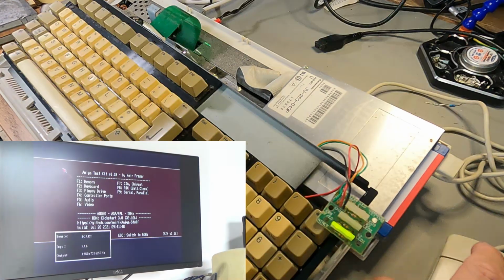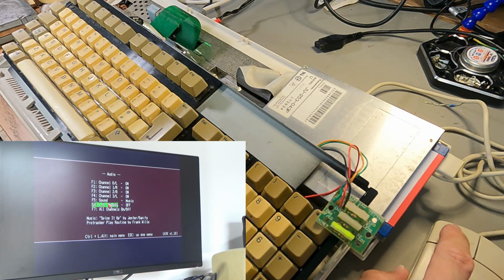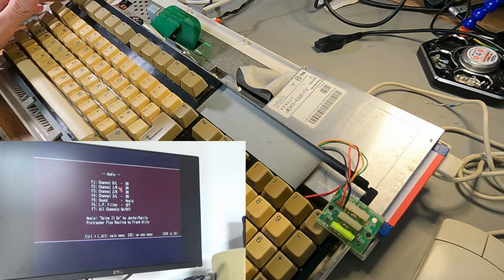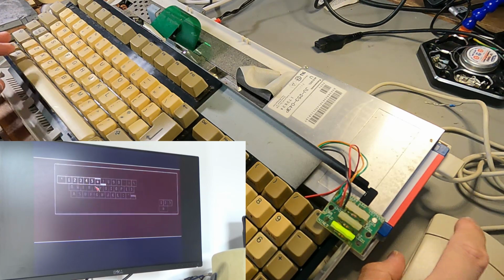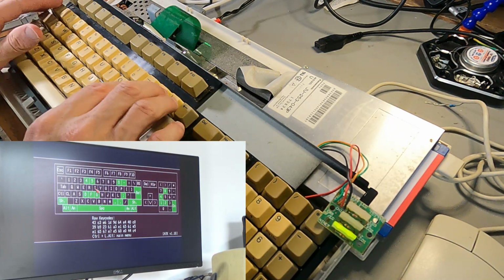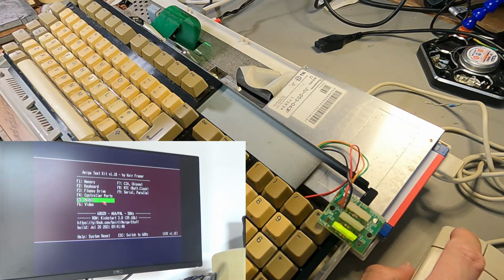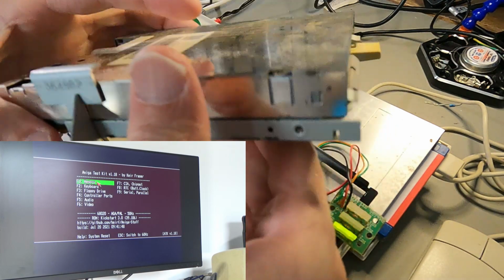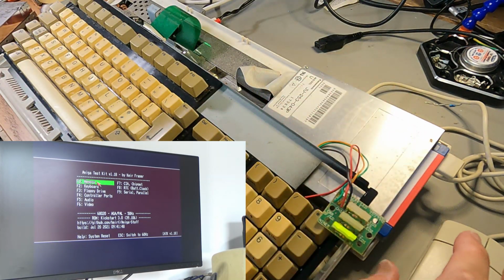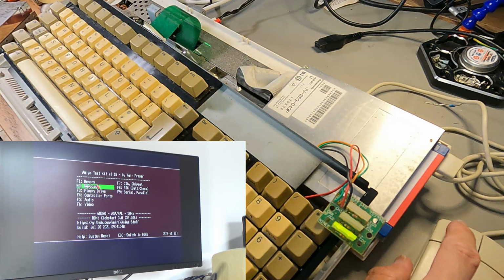So that's good. So audio's on. Yeah, that's working. And I've got the keyboard the right way up now, so we can just have a quick go at that. It seems like mostly that's going to be all right. I'll do a full test of that later. This is looking quite good so far. This floppy drive that was in it has gone bad. And this one actually is bad as well, but it's good enough to boot this Amiga test kit because I think it's because there's so little on the disk for this, it just manages it.